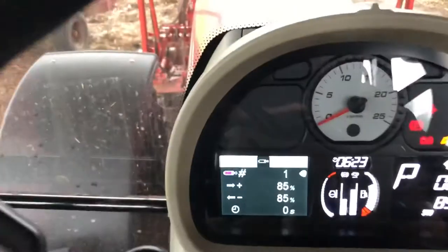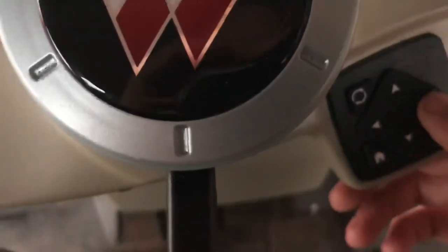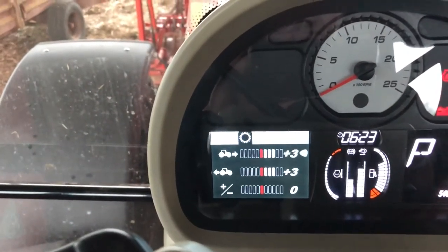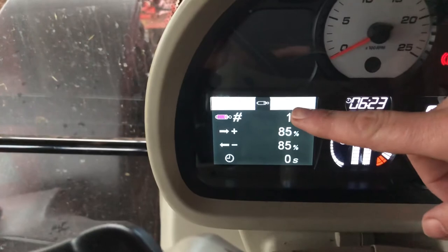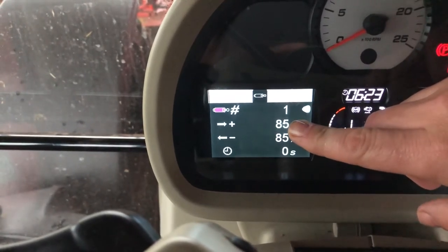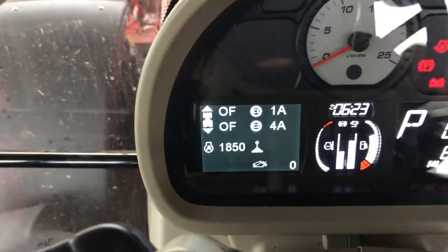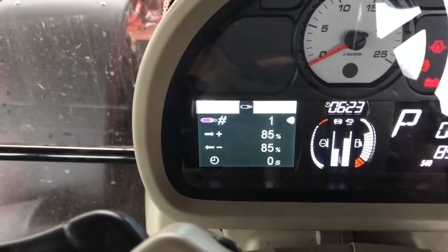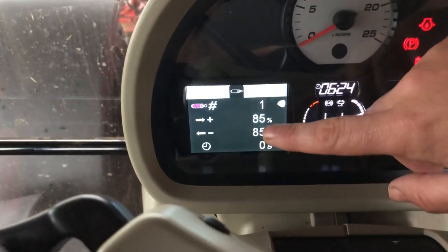If you press across that key it'll push you to that screen. Right, this is the main screen in front of you — you can see that's spool one, that's purple on the back of the tractor. Spool one is pumping 85% out and 85% in. To change the screen, all you do is press — boom — you turn to that and then press cross and go to that screen. Now it's showing pumping 85% and 85%, with no timer on, so you will only pump that much out.